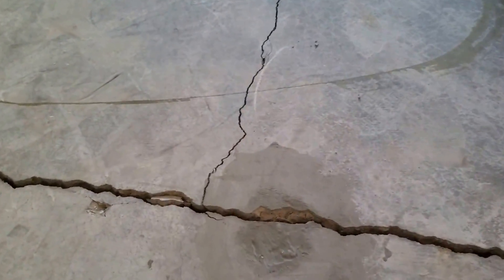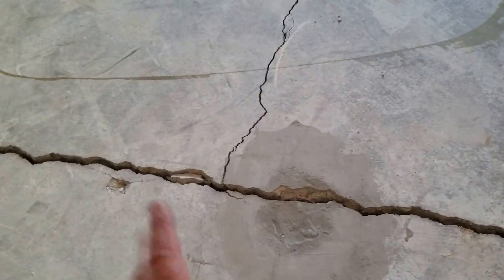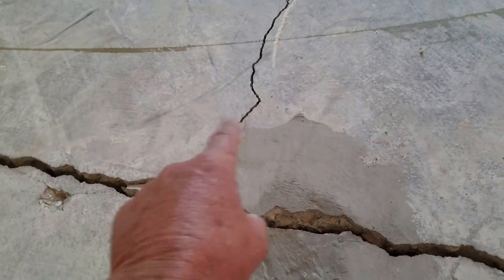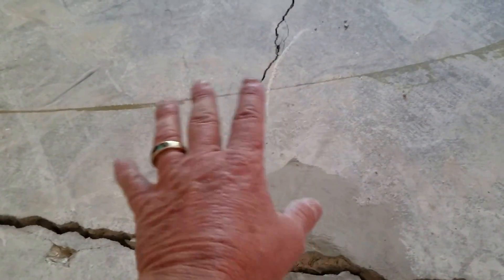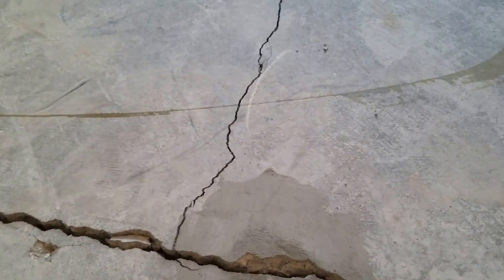It's not necessarily the case of expansive soil pushing up and causing these floor heaves. A technique widely used at home is to simply take a hammer and start tapping near these cracks that are heaved up and see if you hear a hollow sound. A hollow sound means that it's lifting — the foundation wall is going down.